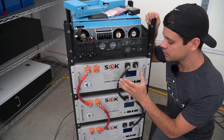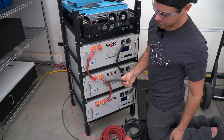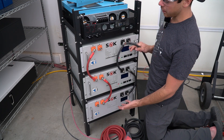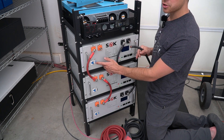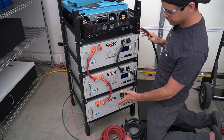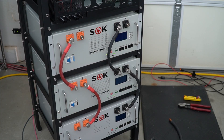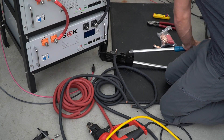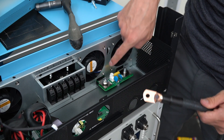Now we need to connect the batteries to the unit, but we need to do a diagonal configuration to avoid current sharing problems. This positive will connect right here and this negative will connect right here. For this unit we're using 2 AWG gauge cable. These batteries have DC-rated circuit breakers that can handle the interrupt current required for having three packs in parallel, so I'm going to connect these directly to the unit without a T-class fuse. If the batteries did not have a DC-rated circuit breaker — which some cheap server rack batteries have — and you have a lot of batteries in parallel in a much larger server rack, you're going to have to use a T-class fuse no matter what. For this configuration with only three batteries this should do fine. Also keep in mind there's an internal fuse to protect the device, so the circuit breakers on the battery protect the conductor and this fuse protects the device.